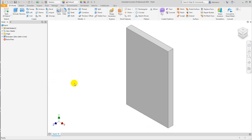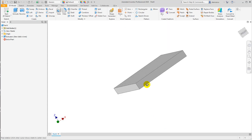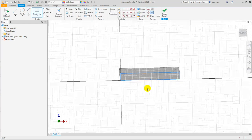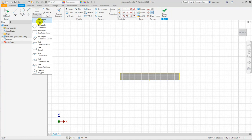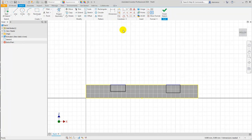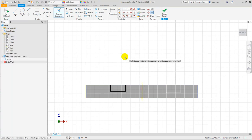Now we'll present it in another position because we want to have good illumination when the assembly will be done. This is the part which is fixed in the assembly. So we create here two rectangles to create channels, one, two. And we restrict this with the symmetry. I'll project that axis, make it constructive, and symmetry.